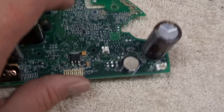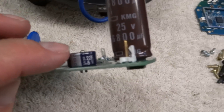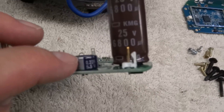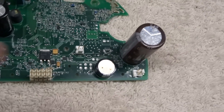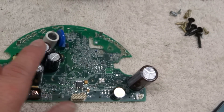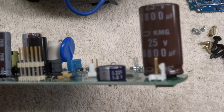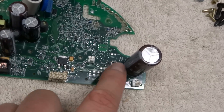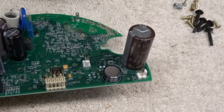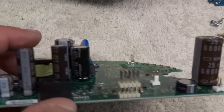I noticed an unusual capacitor here — it's a very low value... wait, it's not microfarads, it's farads. So this is a supercapacitor: 0.22 farads. That is a lot of potential juice — this one capacitor probably could store the juice of all the others and then some. You don't see a lot of supercapacitors in standard electronics because of the sheer amount of power they can hold. I'm curious how much that part costs — it's probably not cheap. Some of these other capacitors are also big physically, like 6800 microfarads.